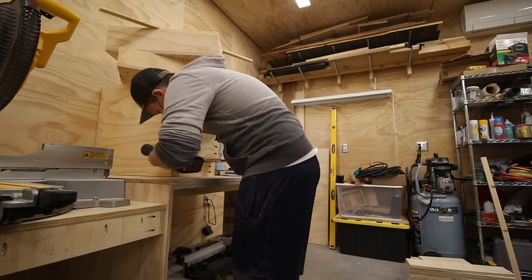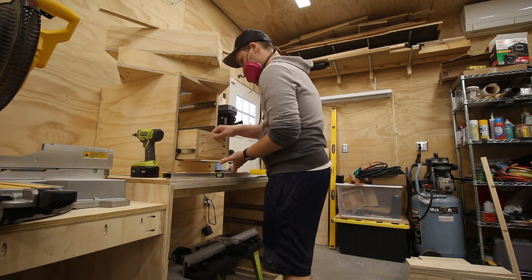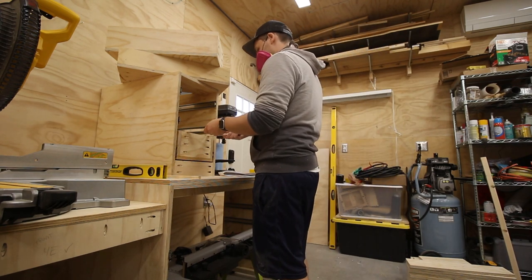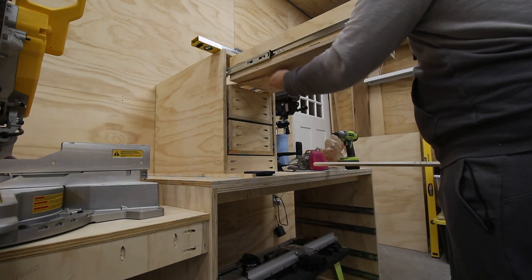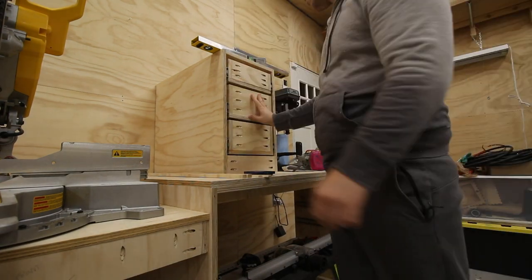To install the drawers, I cut a ¼ inch spacer and a ½ inch spacer. The ¼ inch one was used on the bottom-most drawer in each cabinet, and the ½ inch spacer was used between all other drawers. The first set of drawers — the upper right ones — went swimmingly. The drawers worked smoothly without collision, and most importantly, everything was flush.